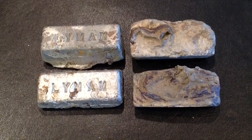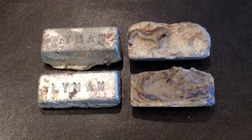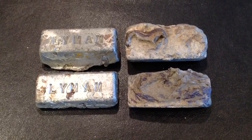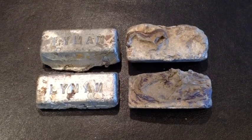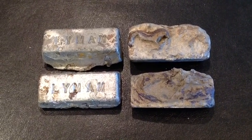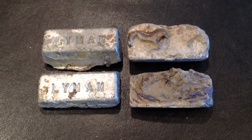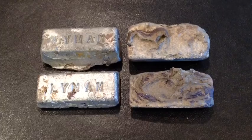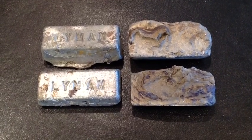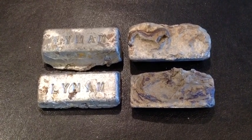It must have been about 900 plus degrees, and there was no YouTube in those days, so I was learning by trial and error. I saved these ingots all these years to remind me to never let it happen again. Instead of the lead behaving normally, a kind of cake icing kept coming up out of the lead. It was cruddy and curdly, and I tried to skim it all out as dross. There were actually a fair number of good wheel weights and lead stick-on type wheel weights that I had melted also, and I knew there was good lead in there I was trying to save.